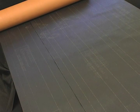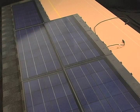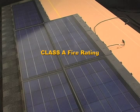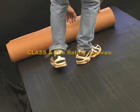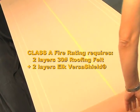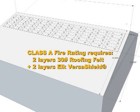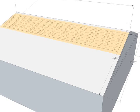The underlayment for the solar electric system is important and will vary depending on the type of installation. Sun Energy shingles have a class A fire rating when installed in accordance with the installation manual, in new construction or in retrofit application. In each of these applications you will need two layers of 30 pound felt and two layers of Elk VersaShield to maintain the class A fire rating. This underlayment is only necessary on the section of the roof where the solar shingles will be installed.